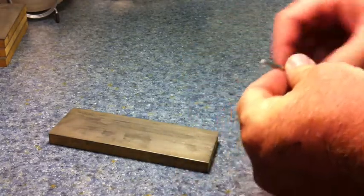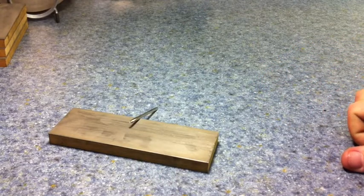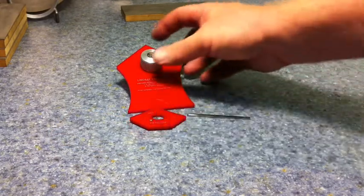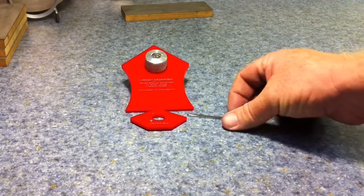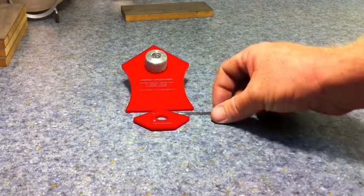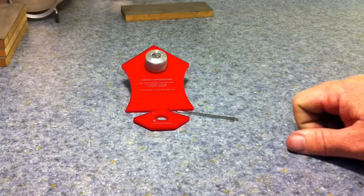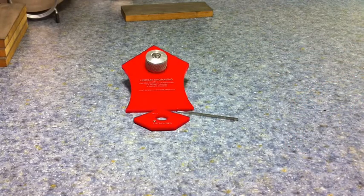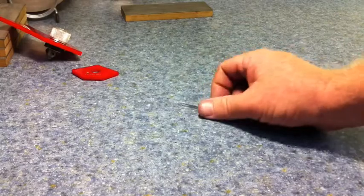This thing is ready to cut, just like that. The advantage to using this type of system over any other on the market is that it's simple and foolproof — it's all about repeatability and consistency. This parallel heel will let you go around really tight radius cuts without dragging; you won't have a little jagged edge behind the graver as you cut. It's inexpensive and you can't tear it up — it's just a great little tool.